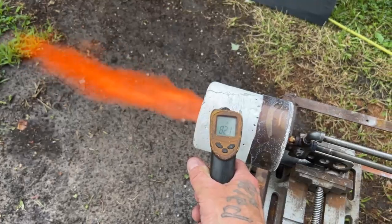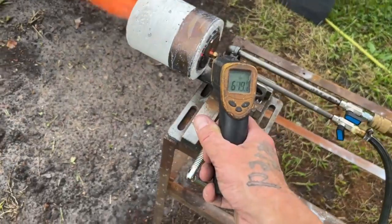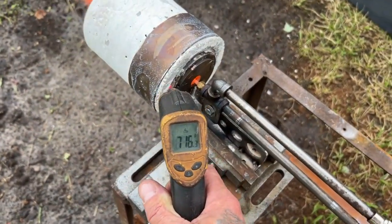Look at that yellow ring around the discharge port — no carbon buildup. This thing's doing pretty good. The max temp is about 922–925 degrees. Unfortunately this camera is incapable of capturing the true likeness of these flames — the frame rate is too slow. I'm thinking I'll try my GoPro at 120 frames per second, that's about the only way we'll be able to observe the natural effects of this flame. It looks like a floppy, lousy, unpowerful flame on video, but in person it is a razor-sharp needle flame — sharp as a pencil.